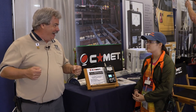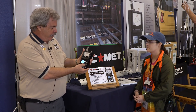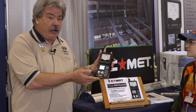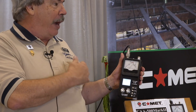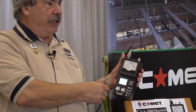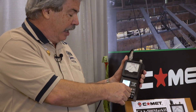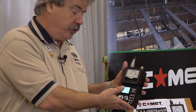What would happen if you have a radio that doesn't let you transmit out of band? You wouldn't necessarily be able to tell where your dip is in your SWR — it could be up above the band or it could be below. Maybe you're really 65 inches when you were designing that antenna and you were way off. That's a very good point. The nice part about something like this is that on the first button push here, you can set the sweep range to go plus or minus a megahertz or a megahertz and a half, and then you can see out of band, you can see in band, just how far out of whack your antenna is. Having that capability is really great. Even if you're not using the graphical kind of antenna analyzer, the ability to have something with continuous coverage really is a tremendous assistance to you.